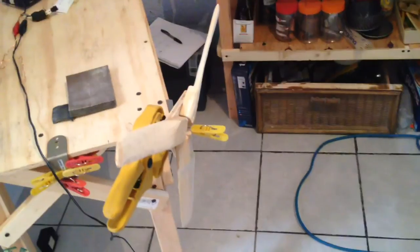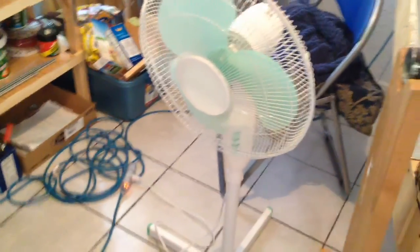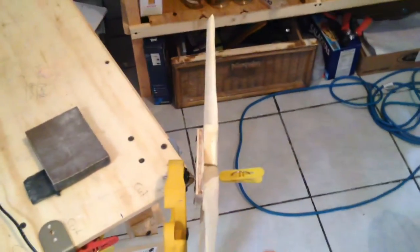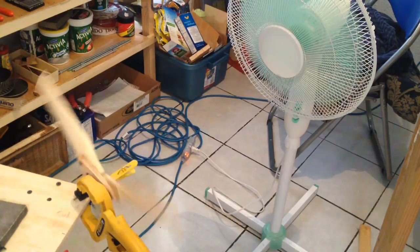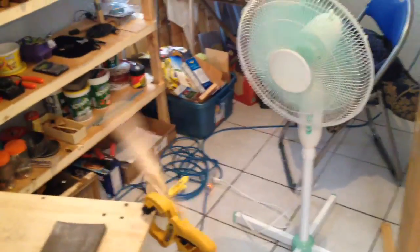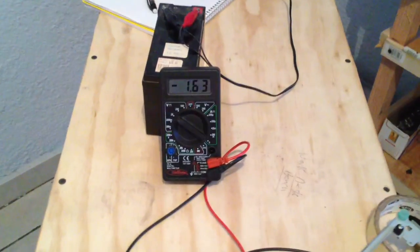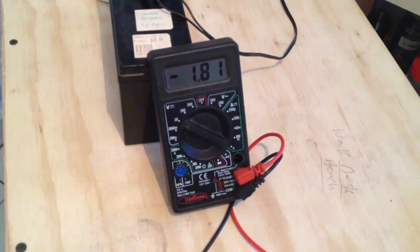So the wind turbine I made works really well. I sanded it a little bit, it's completely balanced, and it can run at very high speeds. This is just a test — I have a $20 super crappy fan, very weak, and I'm going to put it on the lowest setting to get this to rotate. It's on just a metal shaft. And there it goes — startup speed is somewhere around eight kilometers an hour or something like that, but once it starts going it really starts going. Now I have this fan running the wind turbine and I'm checking voltage. The fan is spinning very quickly, powering a motor, and I'm checking the voltage drop across that motor. The highest I saw was 1.96 volts — almost two volts at 20 milliamps. It's quite a bit of power.